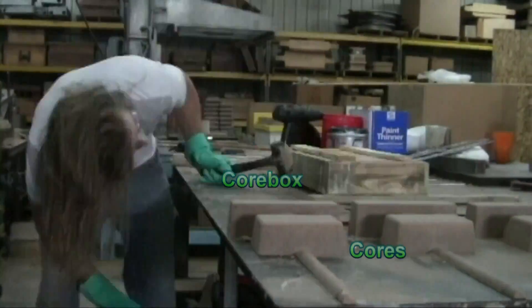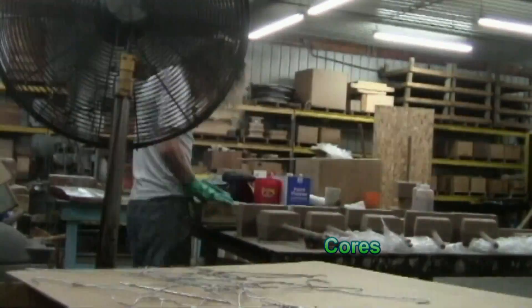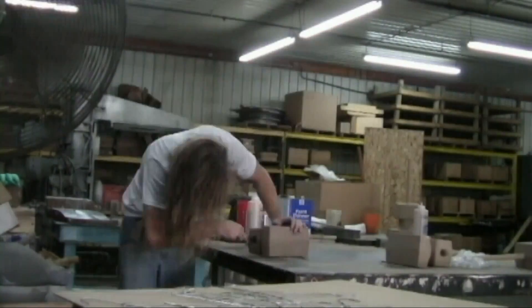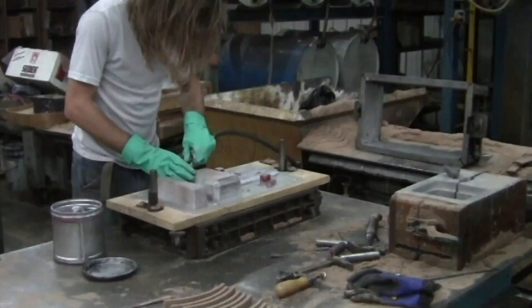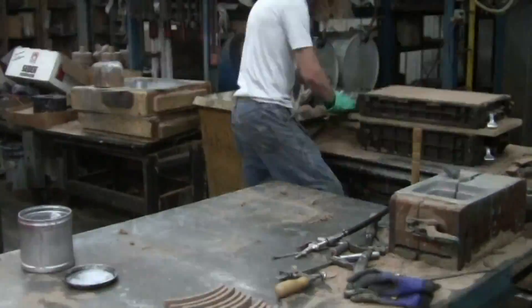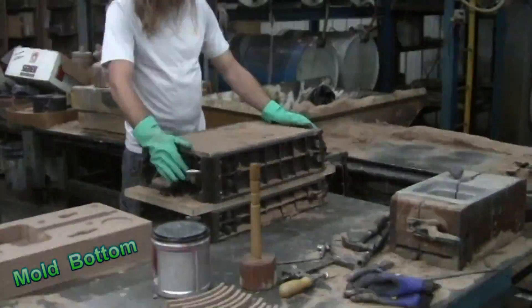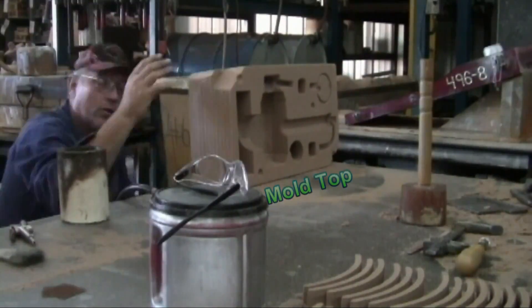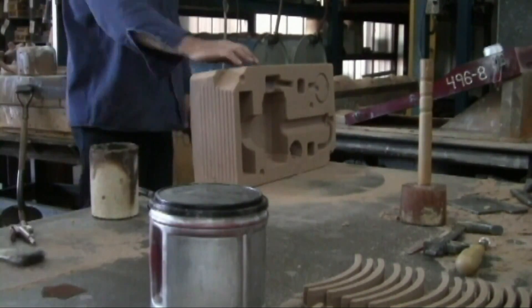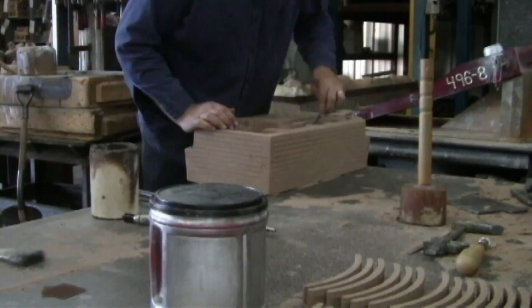Back to making this hammer. I've already taken the parts that I've printed, assembled them, mounted them to a board, made the pattern, made the core box, and I'm now taking the core box up to our air-set molding section where I will make the cores. What you're about to watch is me making the molds from the pattern, but this pattern was actually intended for a green sand mold line and our hopper for the green sand was down the day that I made this video. So instead of waiting, I just made a couple molds in air-set. The sand is a silica sand mixed with a chemical resin and an activator, and it hardens in air — thus the name air-set.